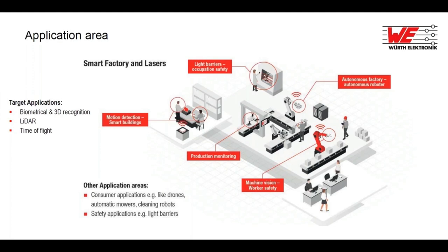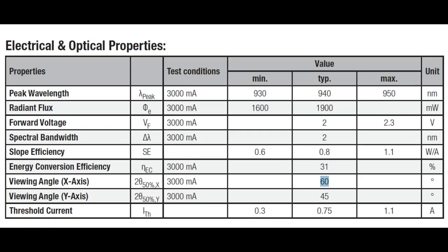If you have a use case where you need infrared light and you could greatly benefit by having it be coherent and by having a very precise wavelength, a VCSEL will do the job much, much, much better than an IR LED. Don't fight with an IR LED. It's not worth the time. This does the job much better.